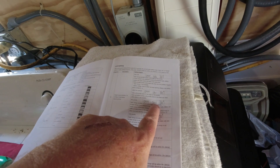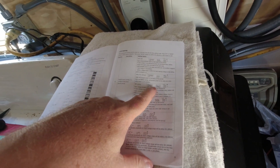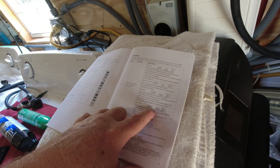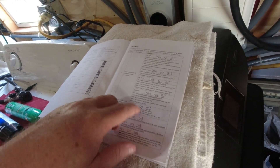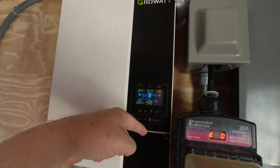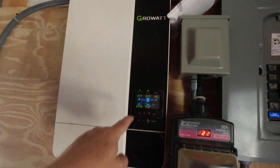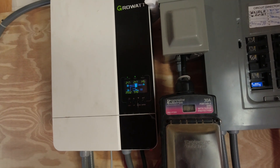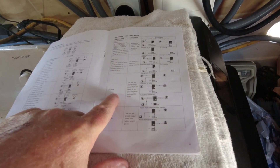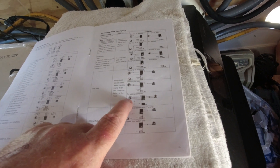What happened was, during the night, since I only have two batteries, we were using a lot — the crock pot, the TV, and I had the air conditioner on because it was a really warm and rainy day, so it was cloudy and I didn't get much charging. The batteries went down by about half. That's why it's topping off on charging now. I switched it to solar, utility, batteries — it uses batteries last when none of the other sources are available. Right now it's charging the batteries and using solar to power the house as well.